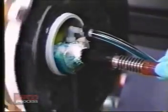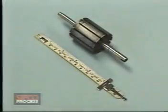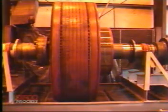One major application that has proven cost-effective is the resizing of bearing seating surfaces on electric motor shafting and end shield housings. Applications range in size from small fractional horsepower motors to large 500 kilowatt motor generator sets.